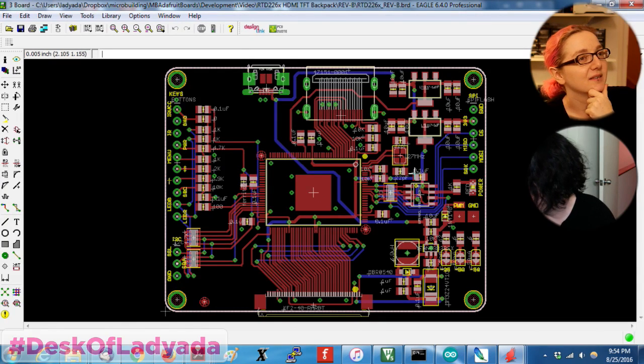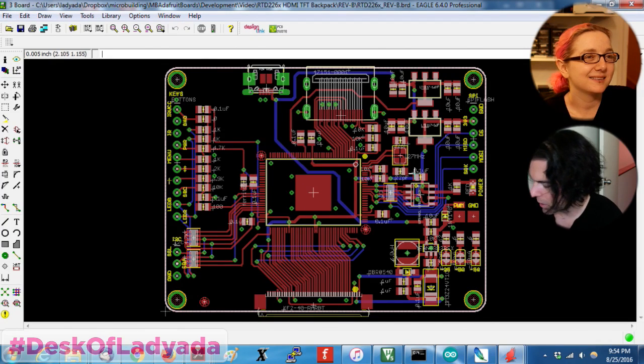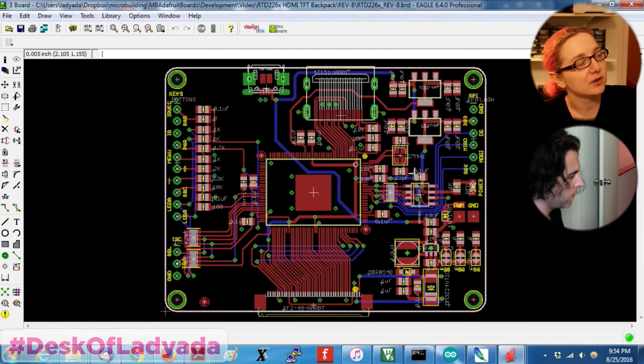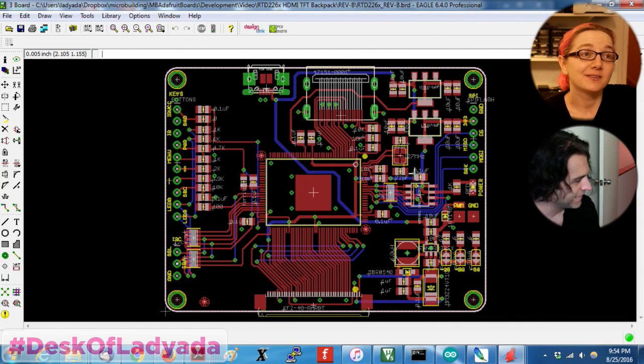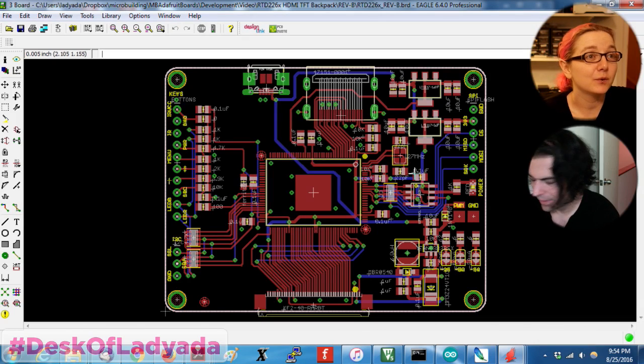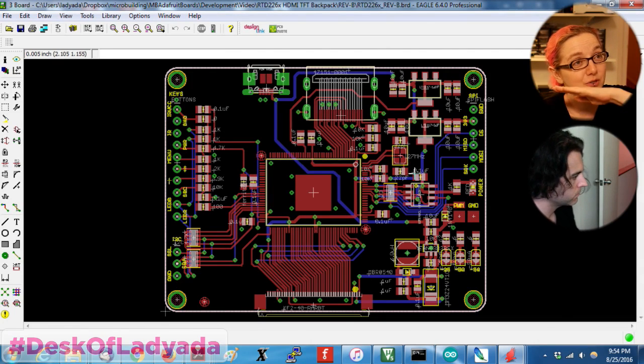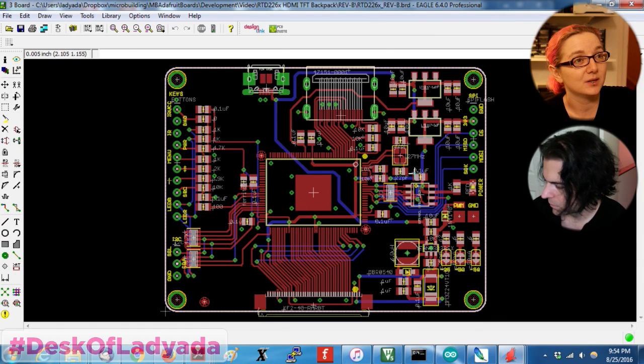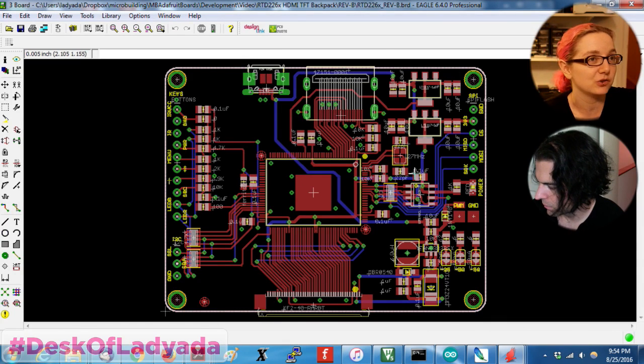I think it's against our lease. Hydrofluoric and fuming nitric for decapping. Yeah. Milling machine. You can mill it, but you have to be careful not to damage the traces. Very slowly and carefully, if you jig it really well. If it's perfectly flat, you could slowly slice off layers until you get to the board, but you won't get the chip. You'd destroy the chip because the chip isn't going to be perfectly flat.